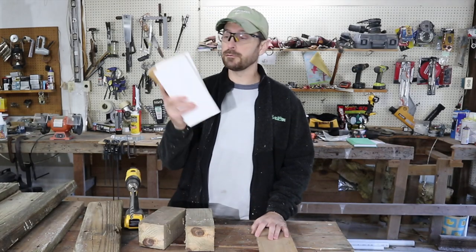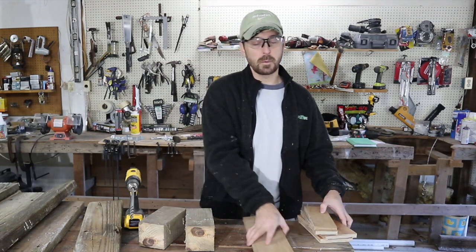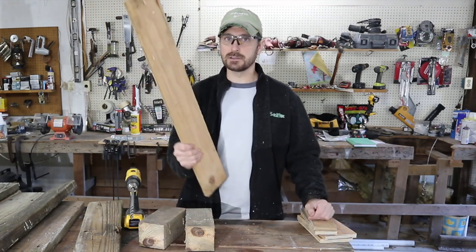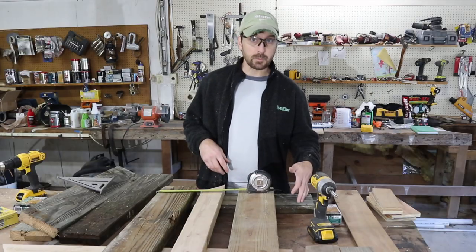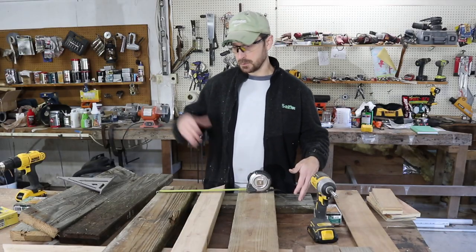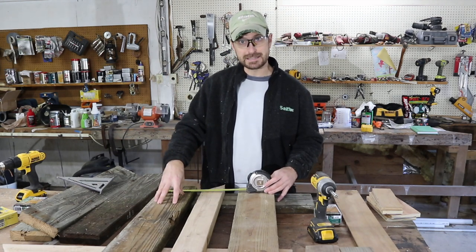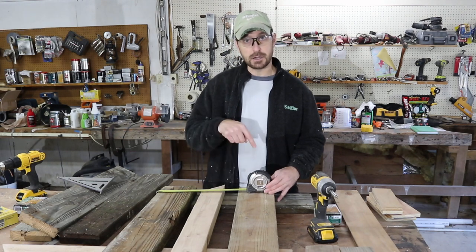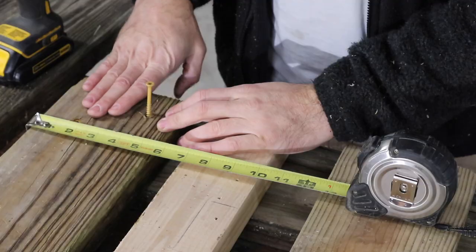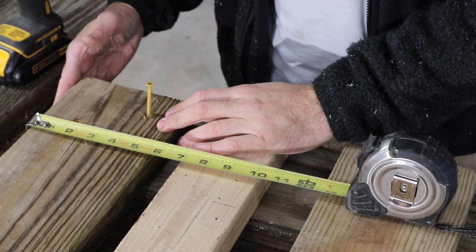For our plywood we want four pieces that are nine inches long and no more than four inches wide. We also want one piece that's 30 inches long and no more than five and a half inches wide. On our bottom rail, which is a 24-inch piece, we're going to place on one end one 30-inch two by six. From there we're going to start working our way across. The two by four is going to be in the middle. We're going to place our first two by six support rail flush with the edge of our bottom rail.